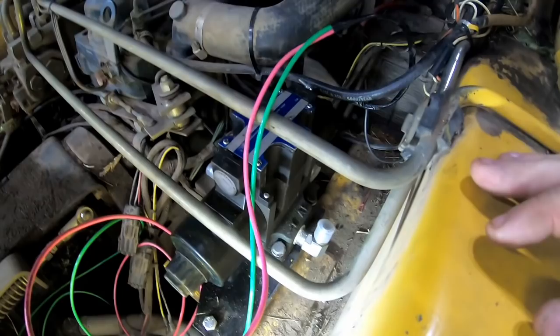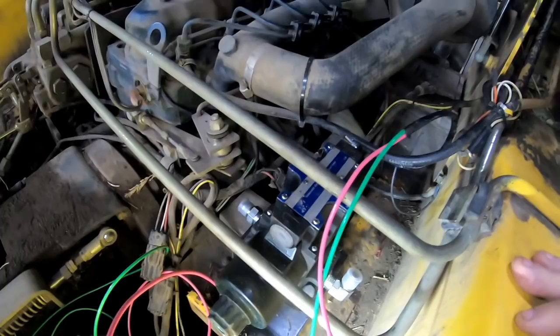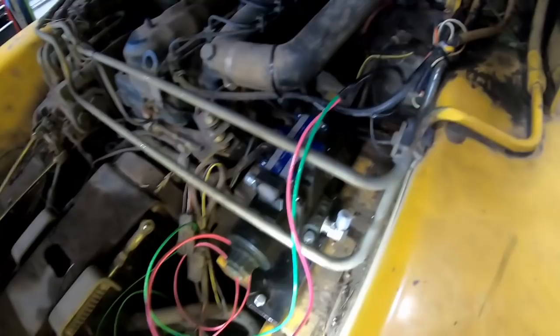And then since they were going down, I would not be able to reach over in here to put nuts on the bottom. The thick plate allowed me to drill and tap those holes so that the base for this valve just threads right into that and bolts down nice. It's all nice and solid. So I got her pretty well set there and started wiring on it.